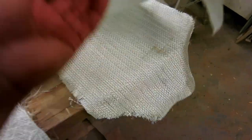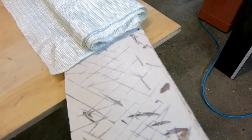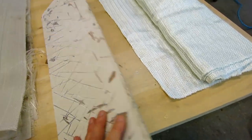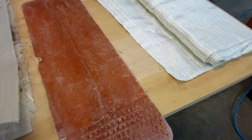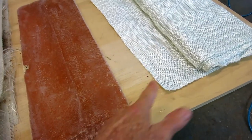I'm going to glass the top first. I'll use two layers of chop mat, two layers of this new stuff I found, another layer of chop mat, and then weight a piece of glass down on top of it for strength. This piece came from the old boat and I've got it carved up so it will stick good - this will be the side that faces up. Then if I'm doing well, I'll go ahead and tab this all in.